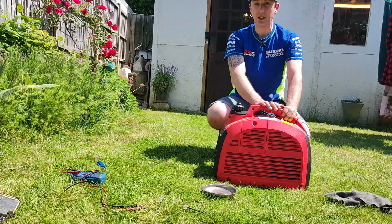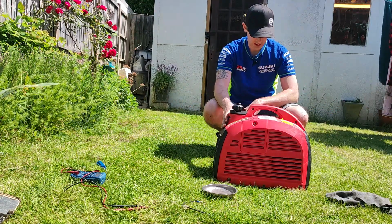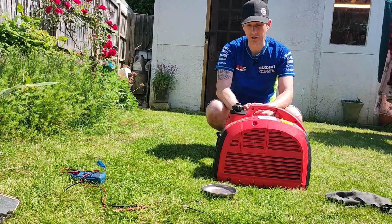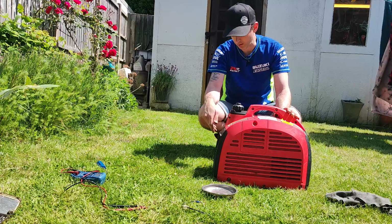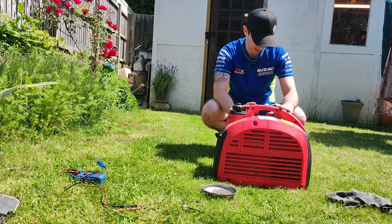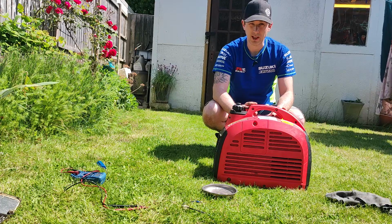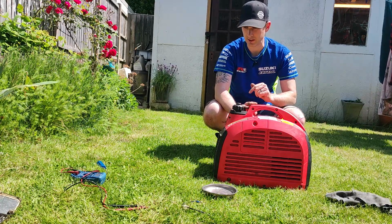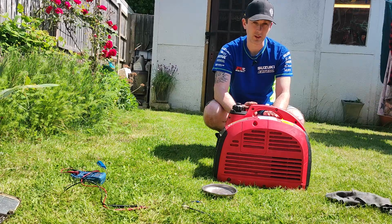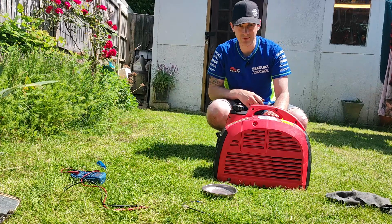Okay, there we go. So if you've got a Swiftcraft generator and it stops producing power, I'd start by checking the continuity of the circuit breaker. Luckily, one of the easiest things to replace, four screws, panel off, swap it over. So I took a bit more apart than I needed to, but happy days, we've got it sorted, the part's in the post, and I can take this with me to Donington next weekend, give it back to Steve, and he can use it to keep his race bike tyres warm. Brilliant. See you in the next one.